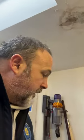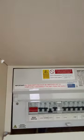Hi there. So this consumer unit here, you don't always have to change the consumer unit because there are ways around it. If you've not got an RCD, as I've mentioned, if you want new circuits, so this customer, for example, wants some new lighting outside, and new lighting outside requires an RCD. But this is their board, and the only RCD they've got is this one here.